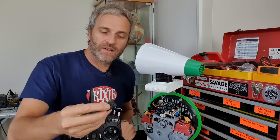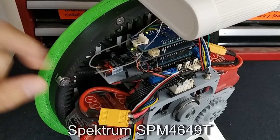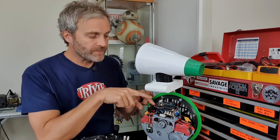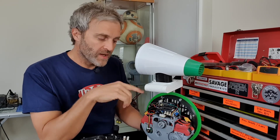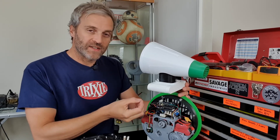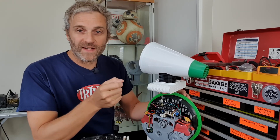The last modification inside Dio's electronics is that I've replaced the standard Spektrum satellite receiver with a slightly better version that has telemetry built in. The problem was that every time I powered up, this receiver would go into bind mode - really annoying, having to re-bind it every time. This happened because when the Arduino powered up, the serial input line was being pulled low, and that's how these receivers are put into bind mode. I had to add a transistor to switch power on and off for the receiver, so after the initial power-up I could power the receiver up when I knew the receive line was in the correct active-high state.